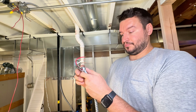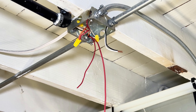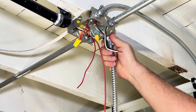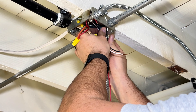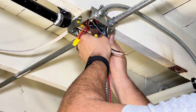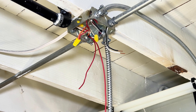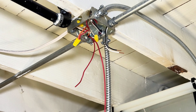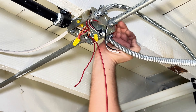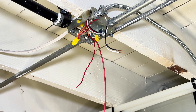The angle can be a little tricky, but you can do it. Once we tighten that down, we're going to put the whip up into the box — got the half-inch knockout knocked out. Put your nut on; don't let those shaky hands slow you down. Once you get that nut on there, take a screwdriver and give it a little knock to get it tight. Then tighten it up so she's not going to move anywhere — nice and snug, ain't going anywhere.